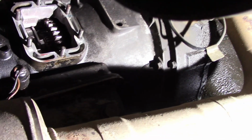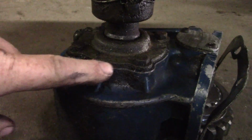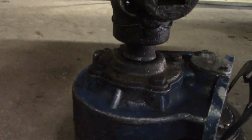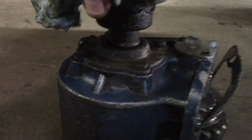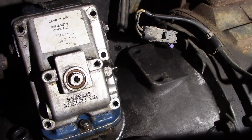All right, so we're under the truck now, and I've got all the studs installed for the PTO and the gears there, which is a great thing. And we're going to try and reuse the PTO from the other truck. I looked up the two transmissions, and it looks like they will interchange, but we're going to have to check the spacing and basically have the gear here, how much play we have in the gear, how much clearance we have between this gear and the other.